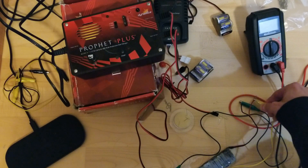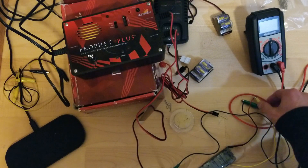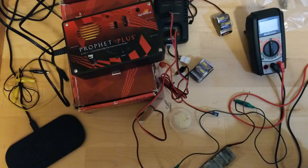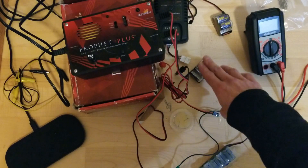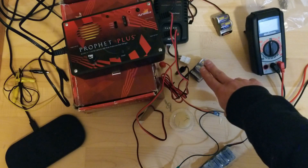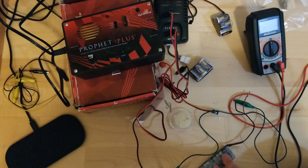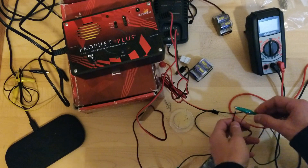So I'm just connecting things up here. Option A is if you have a battery pack that does charge that has the same voltage or very similar, you can tie them together for a little bit of time. What's going to happen is some of the energy is going to go from the high potential down to the low potential. So this will have whatever 7.4 volts, this will have zero or some nominal small voltage, so energy will go into this. It's very similar to tying a car battery together in a jump-start situation.